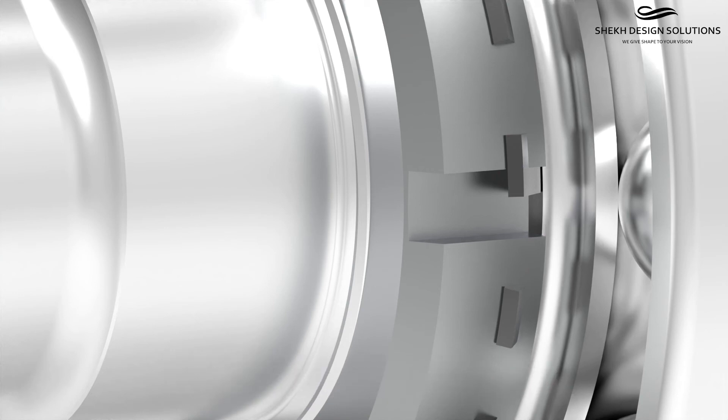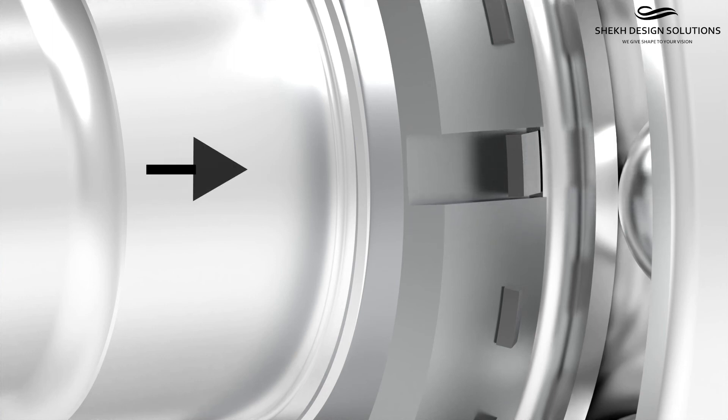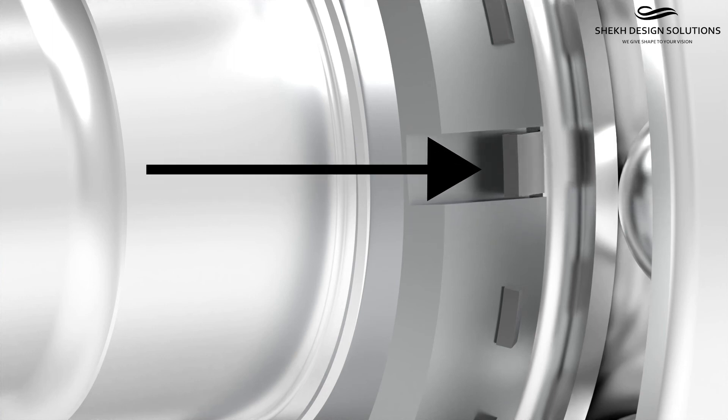Note orientation with the beveled corner facing the bearing. Bend at least one tab into the four keyways of the lock nut, ensuring that the lock washer prevents the lock nut from rotating.